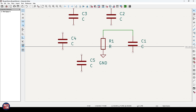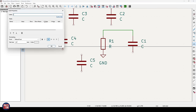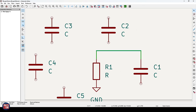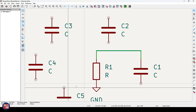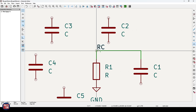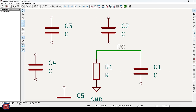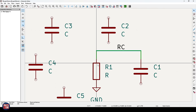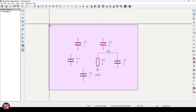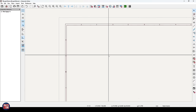Clicking on a net shows the connection name in the bottom left. Adding a net label changes that name to something more sensible. There are many other commands we'll explore as we progress through the video. With the basics out of the way, drag select and press Delete to start fresh with an empty schematic. Now the bit I'd like to start with is our STM32WB microcontroller — specifically the STM32WB55CEU6, a QFN-style package with 48 pins. This will form the centerpiece of the design, and we'll be designing around it.